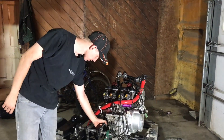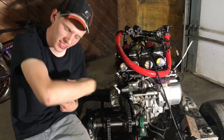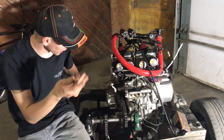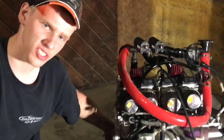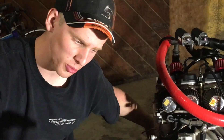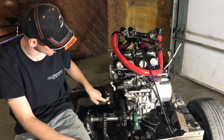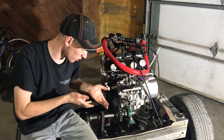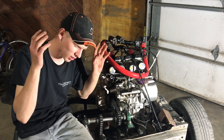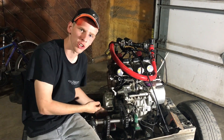After about another hour of painstaking inspection, we found that this motor mount is crumpling and this one needs a gusset because it's allowing it to move just a little bit. The front one is bending a little bit up and down causing this one to crumple, and this one is perfectly fine. So we need to fix that before we can straighten out the jack shaft or put the tensioner on the chain.